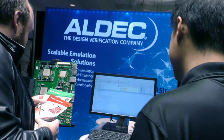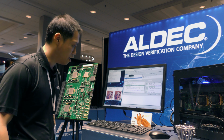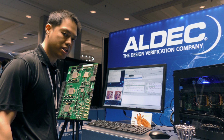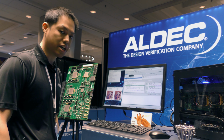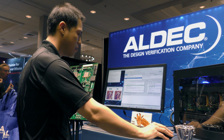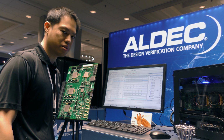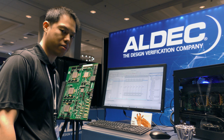The software can be controlled by using a typical GDB flow, so we can set breakpoints, step into code, and run the code, and all the typical GDB debugging tools and features that you expect. So after running your test, you can view your hardware signals in your simulator of choice, and that will tell you what's functioning in the hardware and what's not.